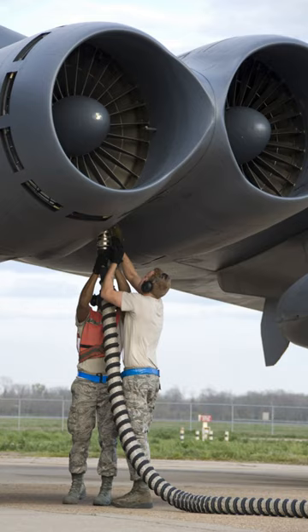An interesting feature of all three German jet engine designs that saw production before May 1945 — the BMW 003, Junkers Jumo 004, and Heinkel HeS 011 axial flow turbojet designs — was the starter system, which consisted of a Riedel 10-horsepower flat-twin two-stroke air-cooled engine hidden in the intake, essentially functioning as a pioneering example of an auxiliary power unit for starting a jet engine. For the Jumo 004, a hole in the extreme nose of the intake diverter contained a D-shaped manual pull handle which started the piston engine, which in turn rotated the compressor. Two small petrol-oil mix tanks were fitted in the annular intake.